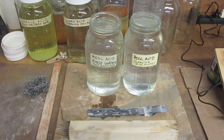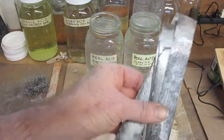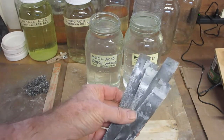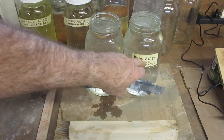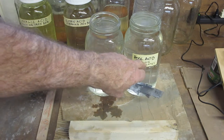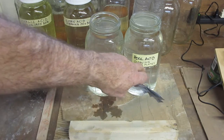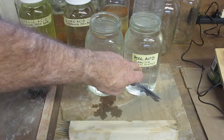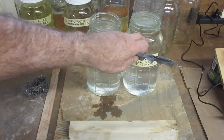This is a video on a cleaning procedure I'm going to try to do with these zinc plates. I've got about six zinc plates here and they've all become darkened by doing a CO2 GANS job. So I made a solution of pool acid — it's just dry acid from a swimming pool, sodium bisulfate. I put in about 100 milliliters of dry pool acid in the bottom of the jar, then filled it up in a 2-quart jar with water.